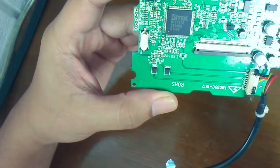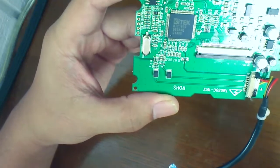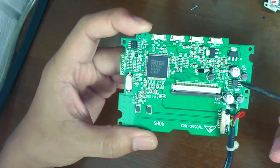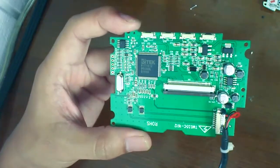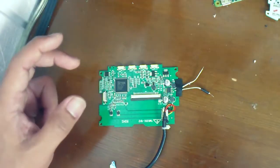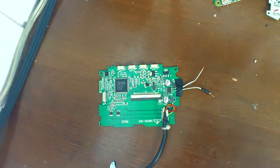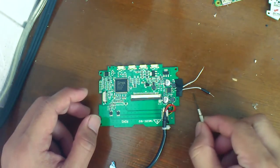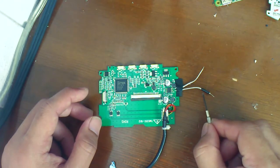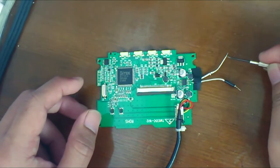So we're just gonna bypass the output lead, connect the 5 volts directly from there, and connect ground, and that power source will come from the regulated 5 volt battery, and connect the ground as well. It's gonna be a challenge because of how small it is. Maybe I'll be able to do it. So as you can see, I was able to solder it, and it was very small. It was a delicate process, but I just made these two wires, usually different colors, but I just designated this black taped wire as ground, and supposedly this will be the bypassed power for this board.